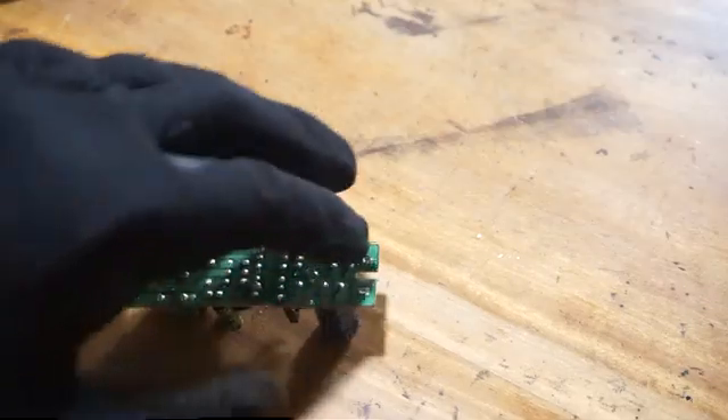If you don't have a standalone electronic ballast, use the electronic ballast that is inside a regular CFL bulb. Make sure to select a CFL bulb that has the same power rating as the two-pin fluorescent lamp itself. Thank you for watching. See you in another tutorial. I'm Sean from learningtostepbystep.com.